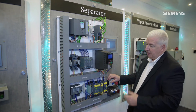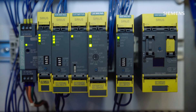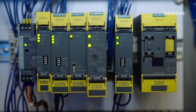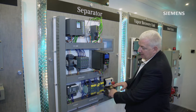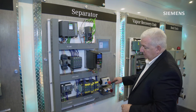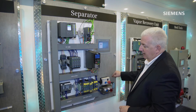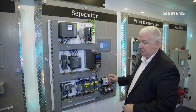With the expandable system it offers multiple zone capability, so I can shut off the system with an e-stop and come back and reset it — a monitored or manual restart. But with a second switch I can have a discontinuation of the power and an automatic restart of the system.